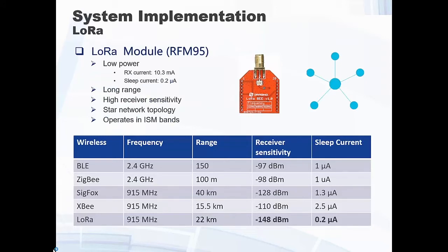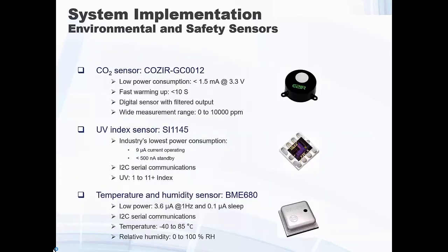The reason we are using LoRa: if you are in IoT, the wireless modules you can use include BLE, ZigBee, Sigfox, XBee, and LoRa. We selected LoRa — there are advantages such as longer distance, higher sensitivity, and low sleep current, which was one of the main reasons. We have used XBee before and haven't compared them in full detail, but our nodes support both XBee and LoRa. Now we are mainly focusing on LoRa.